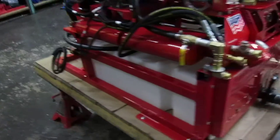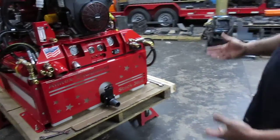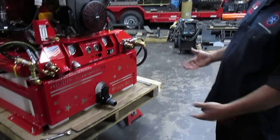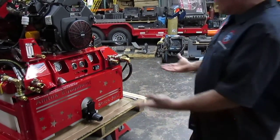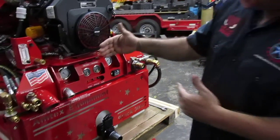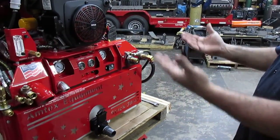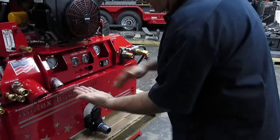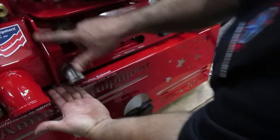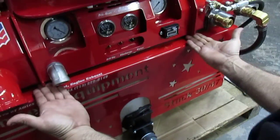Because the panel is off, the best area to lift this machine with a forklift — let's say my hands are the forklift — you need to insert the forklift at least 36 inches inward underneath the machine, having the center of the forklift at this edge right here, so lifting from here would be the safest.